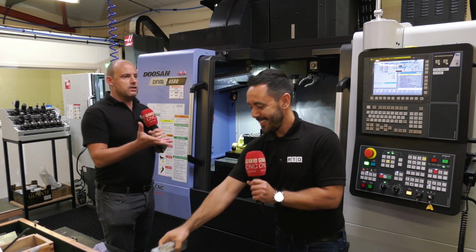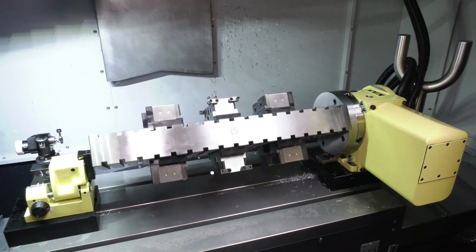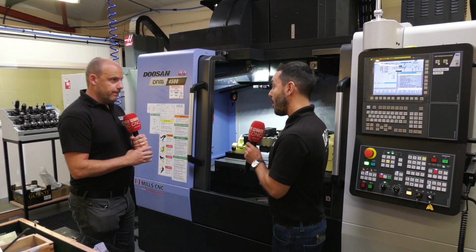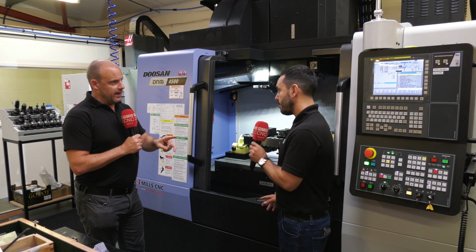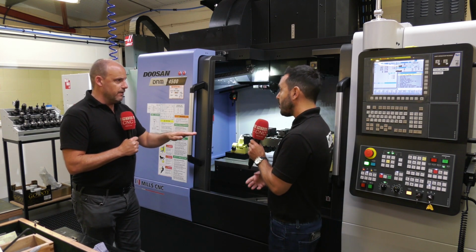Right, so that's essentially one machining cycle to do a complete part. If you had a 5-axis machine, you'd need to do 2, wouldn't you? Because you need to turn it over. The same, but it's 2. You're holding that part twice. Yeah. You're holding the part twice in this setup, but you're presenting more parts to the spindle. Correct. So you're getting more parts, but also with a 5-axis machine, you do have to stop and potentially turn the part over, don't you, to finish the back face.